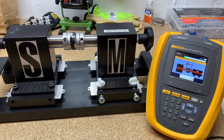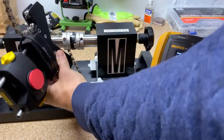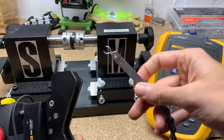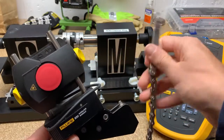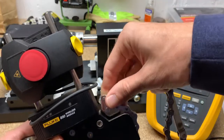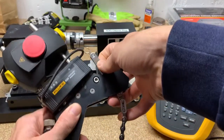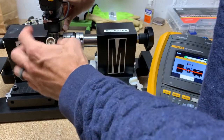You want to make sure the screen matches reality. First we need to set up our laser and prism on the correct sides. For smaller shafts, I recommend taking this piece and poking the metal prong up through from underneath rather than looping around the outside — looping works best for larger shafts. You can also do it from underneath to get onto smaller shafts. Once it's on, tighten the nut to snug it down.